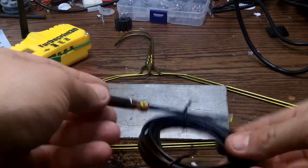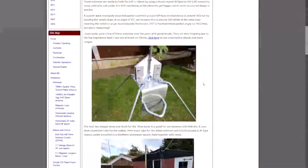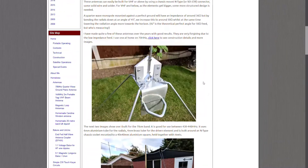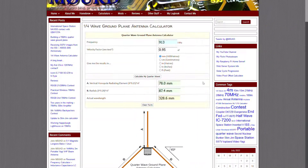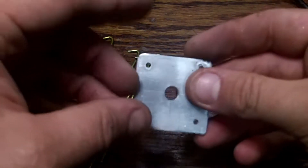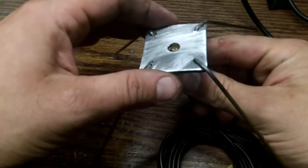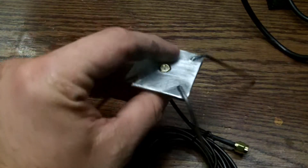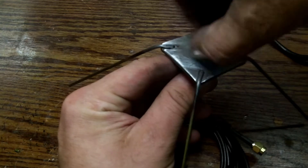After initial testing, I was interested in trying a ground plane antenna. So I bought an extension cord, went online, and found a basic calculator for a ground plane antenna. I built myself a ground plane antenna that works with the stock antenna. I'm assuming that the nut, the ferrule, and everything is grounded or will be connected to the ground plane — if not, this is all for nothing.